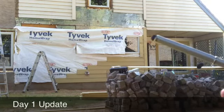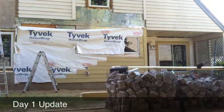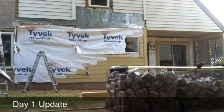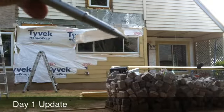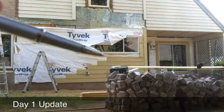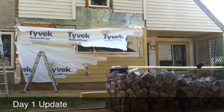If you look underneath the porch this way, right here underneath the porch area — so we'll hide all that. It looks really good. I'm going to show you where I cut the stucco back on the window area, but we're staggering the laps out, putting some first pieces of trim up there, being careful not to cover the weep holes.